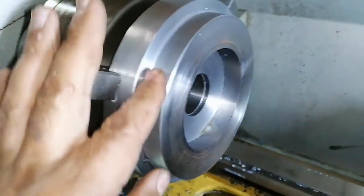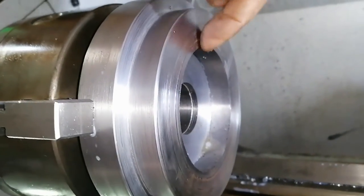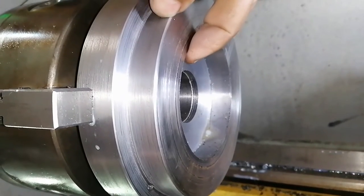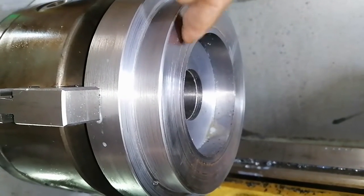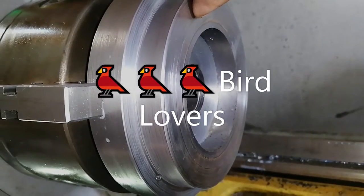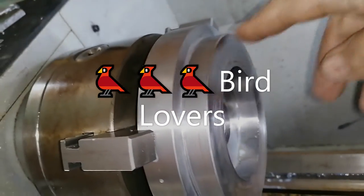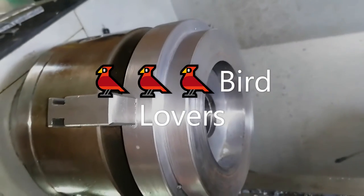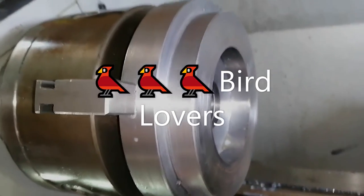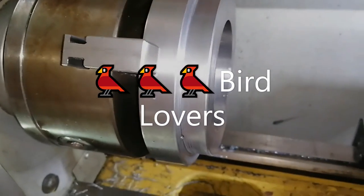I've just finished this face here. My plans have changed a little bit — I set 10 millimeter landing for the brake disc, but I think I'm going to make it bigger just to cater for different size brake discs. Ten millimeters might be too small; the bigger the area the better it is for the brake disc, more landing for it to sit on.